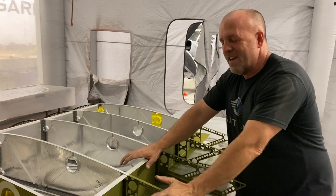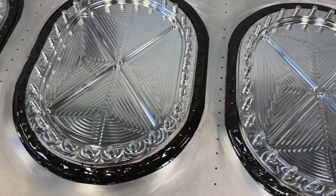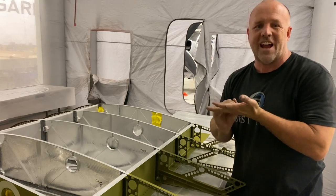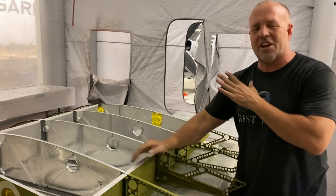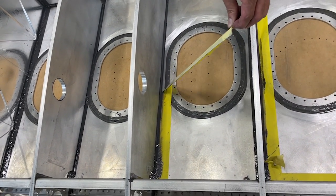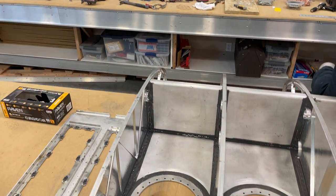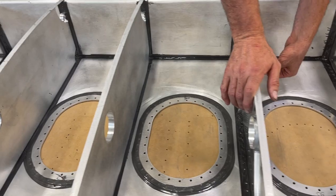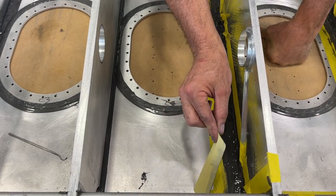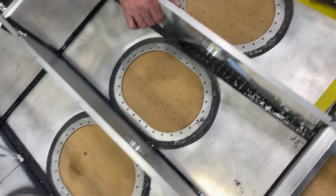Anyway, I really wanted to keep all the inside of my wing, the raw aluminum look, because I love it. And so I started assembling a lot of the pieces with a clear aluminum primer protector between all my layers. And I was gonna keep everything clear coated. And it was really just, for looks during assembly, I guess, and working on it, I just wanted to see the raw aluminum. And then I ran out of clear, and then I called to get some more, and they're on back order for 6 weeks, which there's no way I'm gonna stop 6 weeks. So I called up, ordered several cases of the zinc chromate green, and quite frankly, it's going a lot better.